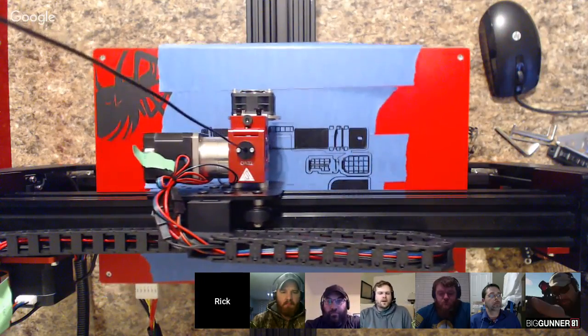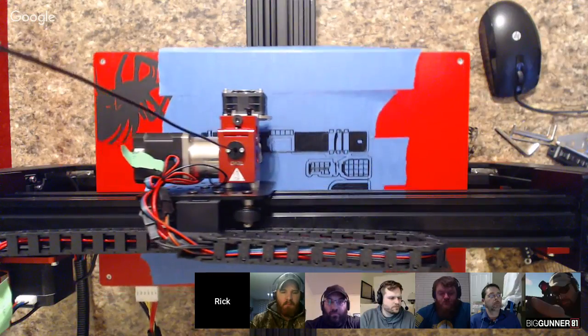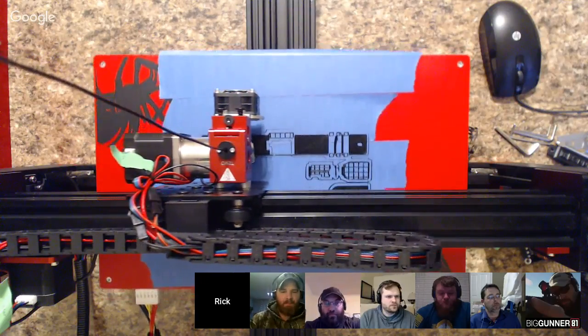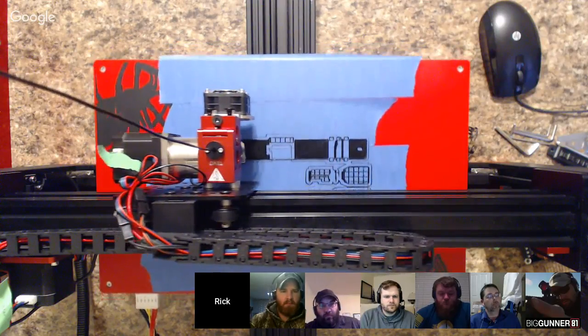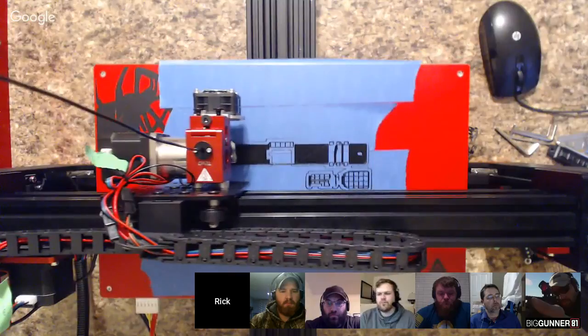But the further out, it got smushed a little bit because as it was printing, the sides of it printed pretty decent, all things considered, as it was working its way up to the halfway point of the barrel. But I think it started to droop at the top or something, and it made it more oblong shaped and not so much cylindrical like it's supposed to be, if that makes sense. That's why I wanted to have my other camera so I can actually show this, because I have it in my hand right now as I'm describing it.